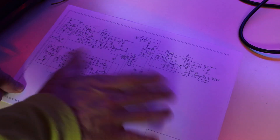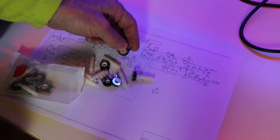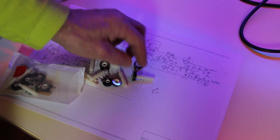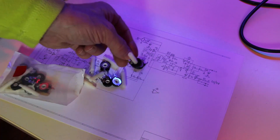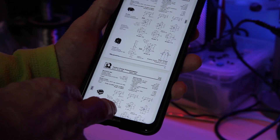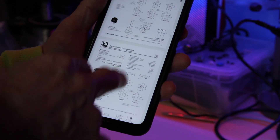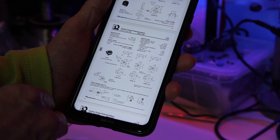But what I did was completely wrong. When I design circuits or do stuff, I usually check the specifications, and I already used these trimmers in the past as a potentiometer, like this, as you can see here, and I'm sure these withstand the operations as a potentiometer. It is always possible to make mistakes, and certainly here I made one by overlooking the lifespan specification for the preset trimmer I used, which is a different brand than the one I already used in the past.